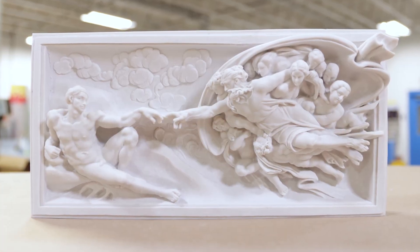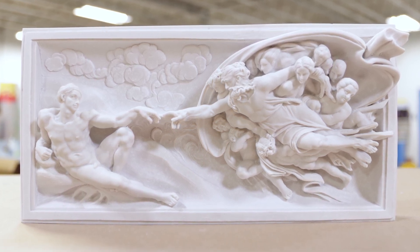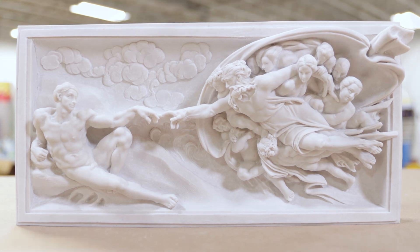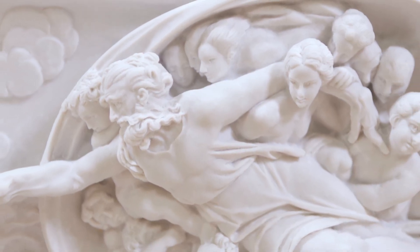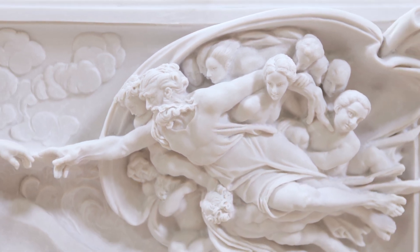The Dual Matrix Neo copied everything inside the mold down to the smallest detail. Because we used the pressure chamber, our casting is bubble-free on the entire surface and is deemed a success.